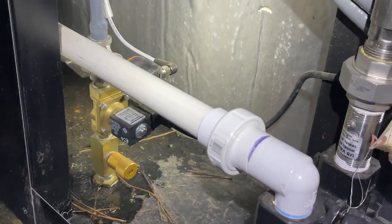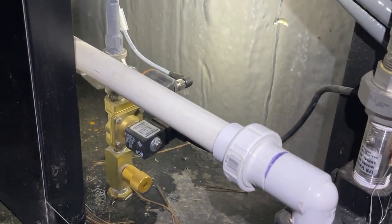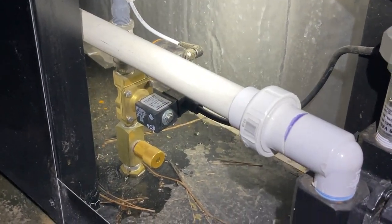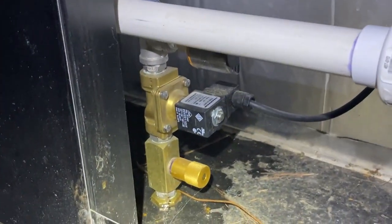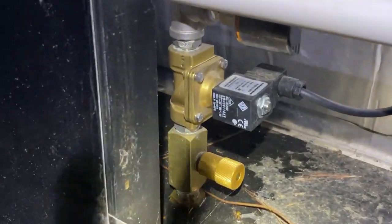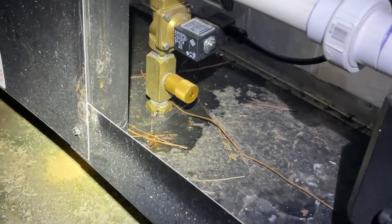What I was telling Wild Edge, and what I commented on my Facebook post — I'm going to upload this as a new post — what I think we need to do: when you shut your pump off, shut your water off, drain your main system. If yours is exposed like mine — I know a lot of guys have their kiln set up inside so it doesn't matter — drain out this main line so it's voided. Then turn your pump back on for just a second, because when you do, it's going to call for water and it's going to open this valve. That little bit of water stacked in here is going to fall back into your supply down there.